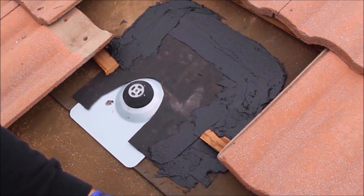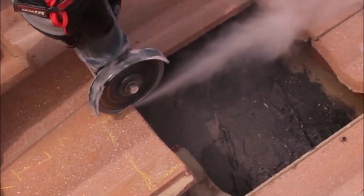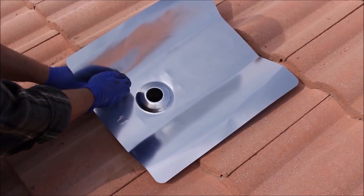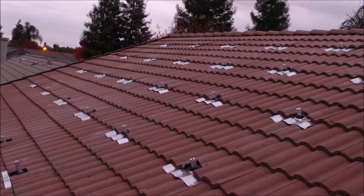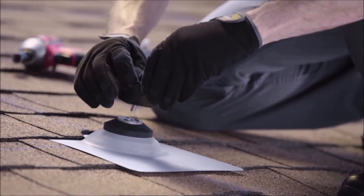To review, after the roof mount and flashing are installed, proceed to measure and cut an area in the tile roof through which the roof mount will protrude. Once cut, place the tile back into position, then shape and fit the tile flashing to the contours of the tile material before installing the posts with roof sealant and the seated rubber cap.